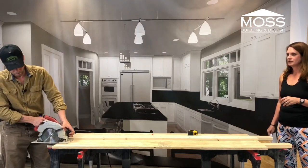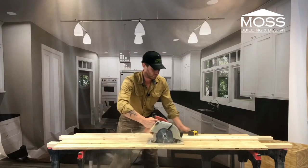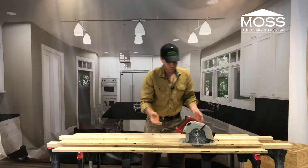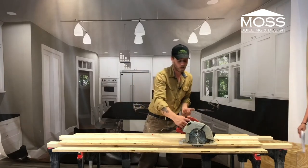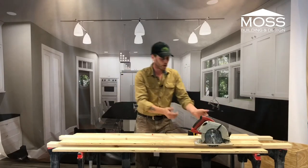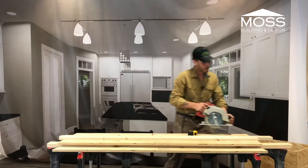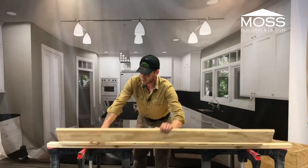I'm comfortable with this tool enough to naturally navigate around the board. As you can see, I turned from a two-hand cut to a one-hand cut without thinking about it. Setting your cut up is really the key to doing a good cut. If you weren't as comfortable, you'd want to keep the saw on this end and cut this way. Where our piece is going to fall is part of setting up the cut — I let it fall down on my saw horses, and it was fine.